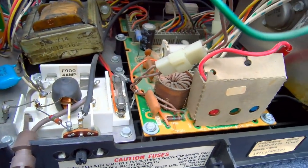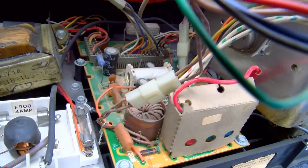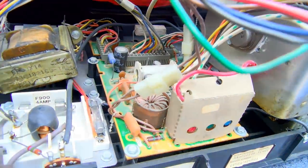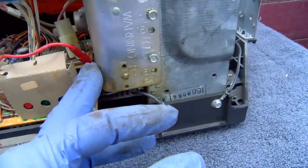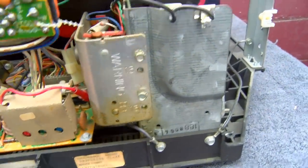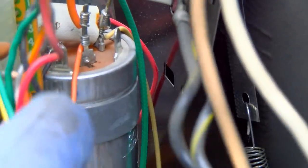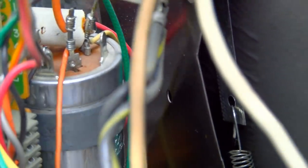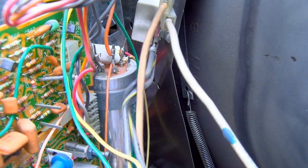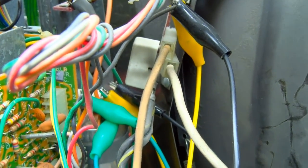The beautiful little fuse block. With this big electrolytic capacitor back here, the first thing I'm going to do is put some clip leads on it. It's been sitting overnight, but I want to short it and make sure it's drained and doesn't have a charge in it, because it'll ruin my tester. I've got every lead of the capacitor grounded — I'm just going to let it sit for a few minutes.